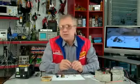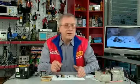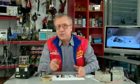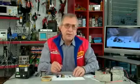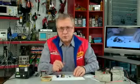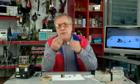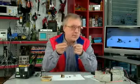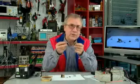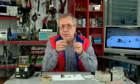Let's have a look at a simple connection circuit including a photodetector, which, for example, in the future can come in handy for testing remote controls, often used to work with a variety of appliances. Let's take a common photodetector. It has 3 pins. Red is positive, connected to a regulated 5 volts output, and the mass is common.